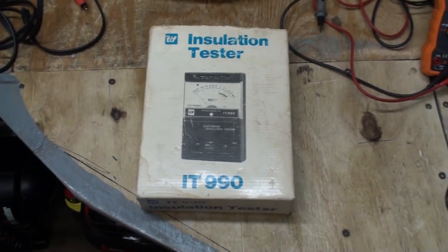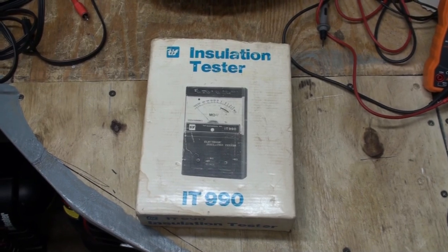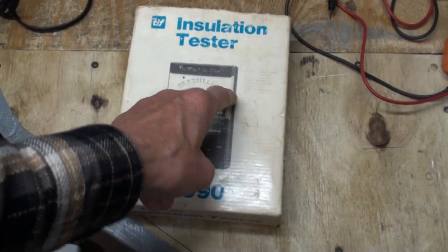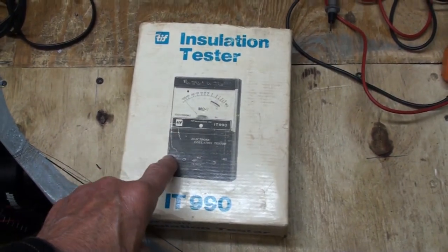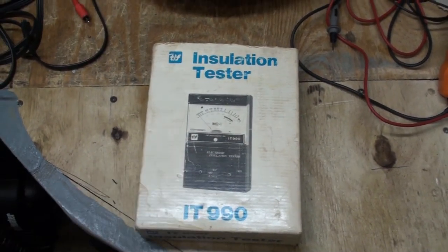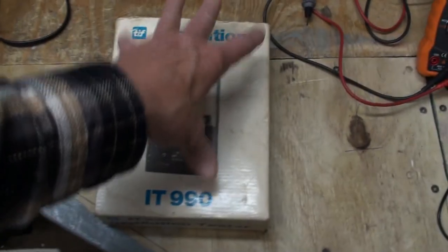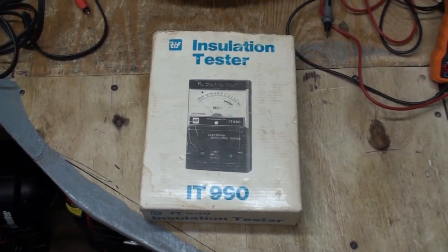If the voltage is not on pin 12 on this circuit board, that will be the end of this series, because I'm not going to put a TL494 in here unless pin 12 has positive on it. And as I recall, I think pin 7's a negative. If that's not the case, then we can't try out putting the TL494 in here, in which case this will probably just go to the ham auction.